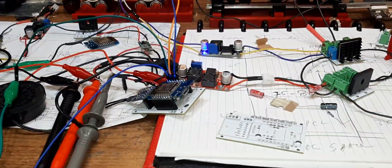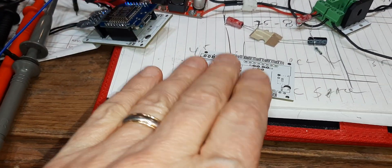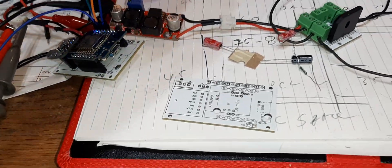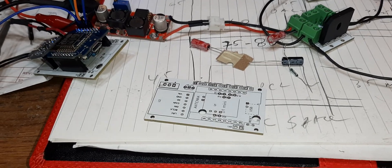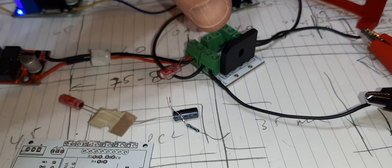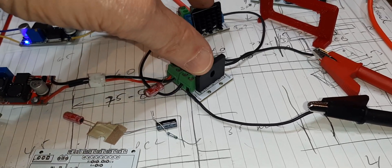Here's where we are — I'm selecting parts for the final assembly. I've got the puff and chuff and soundboard figured out. I've got a one buck boost board which will provide five volts to the soundboard regardless of what the transformer is set at, and I put a buck board here that just keeps everything down low without boosting, since that creates problems with the logic sometimes. I've got two rectifiers and two power distribution centers — we're going to consolidate this to make it cleaner, but the trick was to split the rectifiers to get less noise.